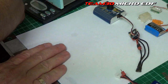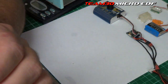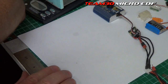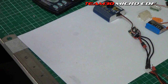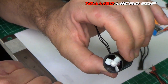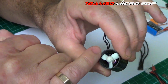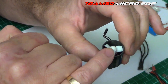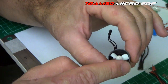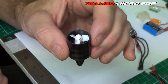What I did — I actually used BluTac. I usually suggest tape, but this is so slippery that the tape wouldn't adhere to it very well. I think I might have blown the BluTac away! I used a little tiny ball of BluTac and stuck it to the hub. I moved it around until it went quiet, or the quietest, then started drilling on the opposite side, taking off a bit of BluTac at a time until there was no BluTac — just holes — and it balanced. I've got a video of that way back.